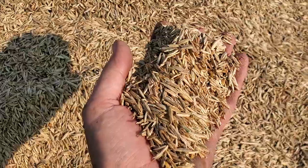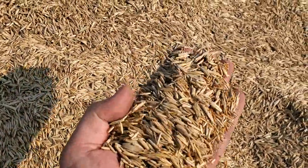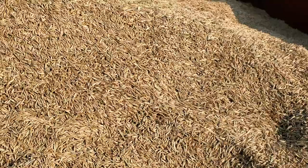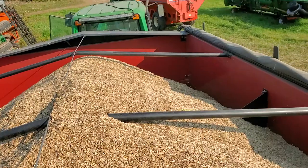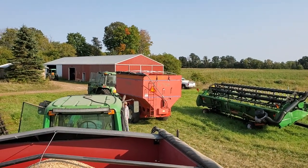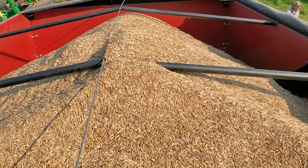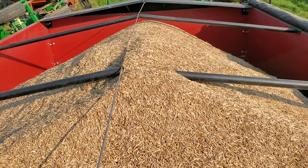After it's gone through the combine again, there are still unthreshed kernels in there, but there are threshed kernels too. By volume we have probably 60 to 70 percent of what we had before — that green cart up there was two-thirds full, and this is about as full as it is now, a little less or a little more. We ran all this through on different settings primarily to get it to flow, and it'll flow now.